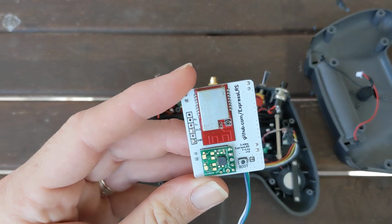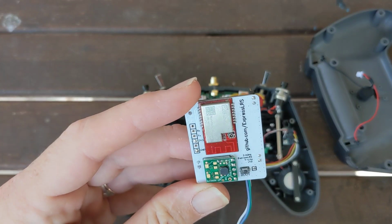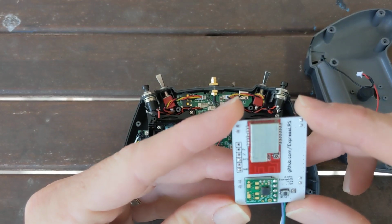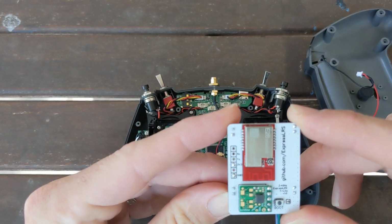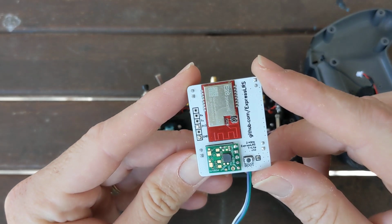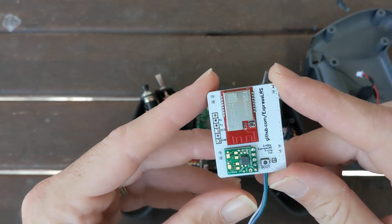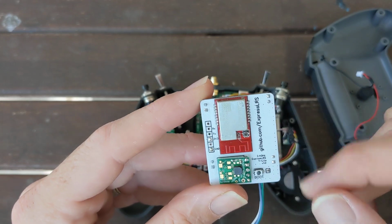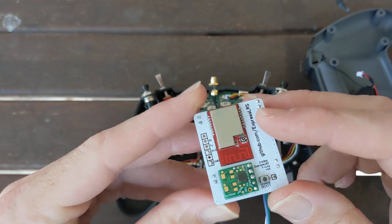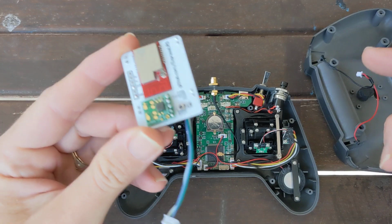And this is probably the only special component on here, the regulator. So this regulator is the S9V11F3S5. It's a step up/down regulator. So it takes VBAT and just outputs a constant 3.3 volts. So it'll work with the LiPo at 4.2 volts down to, I think, 2 volts. So your module will never brown out, and you also won't have any issues delivering a full 250 milliwatts if you want to, because we're bypassing the step up regulator that comes with the module.